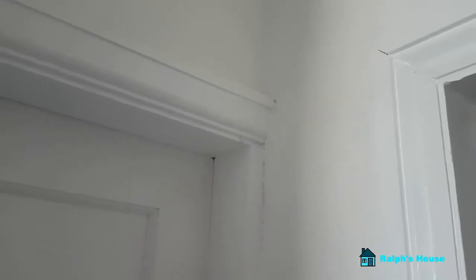When I first moved into this house, there was just a cupboard here — no door, all filled up with plasterboard. I did manage to source some doors locally which were an exact match — I think I paid £15 for three of them. I fitted this door some months ago but finally got around to painting all this. Sadly, when my father put a cupboard in he cut into a lot of this architrave, so I had to replace that one. I managed to salvage it from around the kitchen door. I should just glue that on with quick-setting adhesive — no nails type stuff.